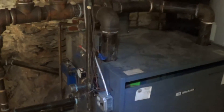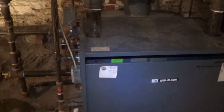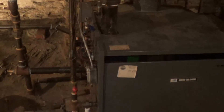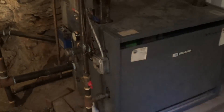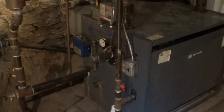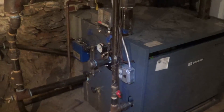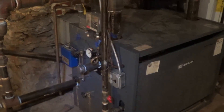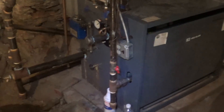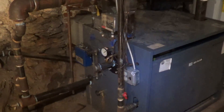Now the boiler's fixed up. One other thing — it has a mercury thermostat, which is going to short cycle. I notice it takes this thing about 30 minutes before it builds up enough pressure to get the steam all the way to the top floor, because this feeds four apartments. So I'm going to swap out the thermostat and go with the Honeywell, set it for steam. The steam's going to limit to a one-hour cycle, so every time it runs, it can get enough head to heat the entire building evenly, rather than short cycle and heat just the first floor. So everything's looking good. This job's turning out well. I hope you liked the video — thanks for watching.